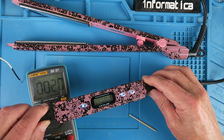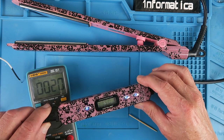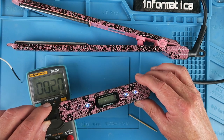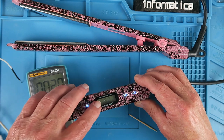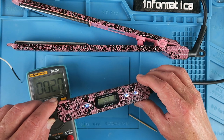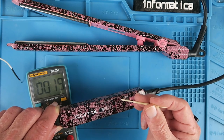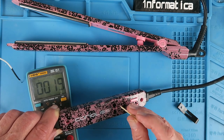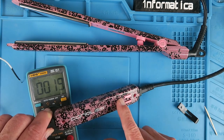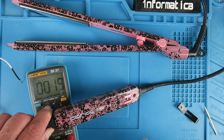I've reassembled the unit, powered it on and off several times, and it's now been on for probably 15 to 20 minutes with no sign of the previous problem. I thought I'd check the temperature reading and found it was five or six degrees out. Just removing the clip off the back and trimming down a cocktail stick, I can get in there and gently adjust the potentiometer. Before final reassembly I'll put a piece of tape over that hole to hopefully prevent the problem happening again.